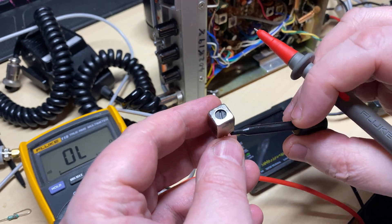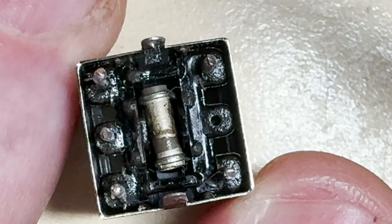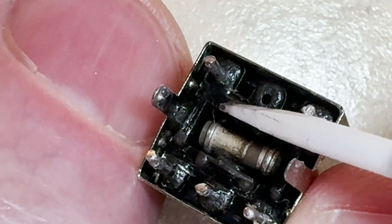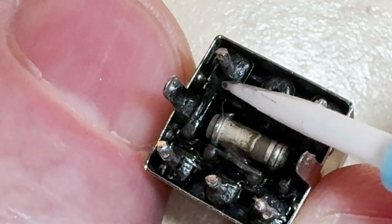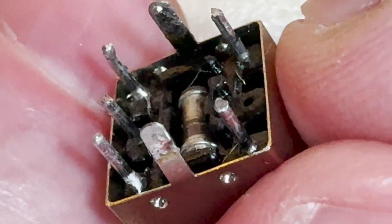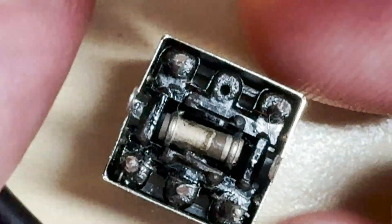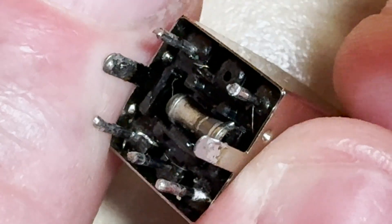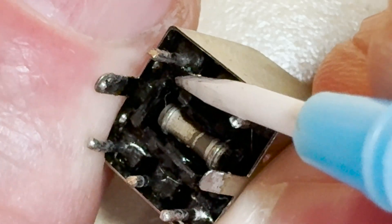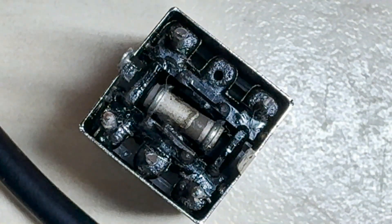As you can see from back in the video, I was so close to it. Let's have a look and see if we can spot what's wrong with the coil — we've got it really close up on the phone. You can see that one of the wires has corroded on the coil. I did actually put in a test coil from another scrap radio and it confirmed this coil was the problem, but the screw slug was all the way at the bottom, suggesting a slightly different value. That's why I've gone for trying to repair this coil — to keep it as original as possible. We have a loose wire with a little bit of green corrosion on it.